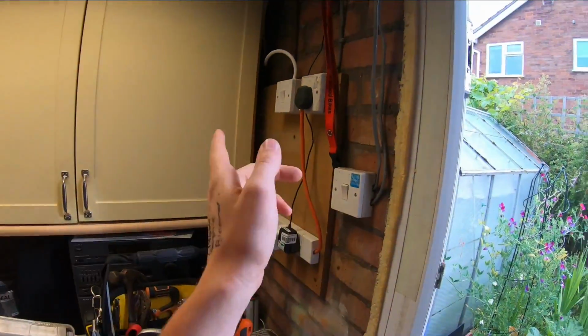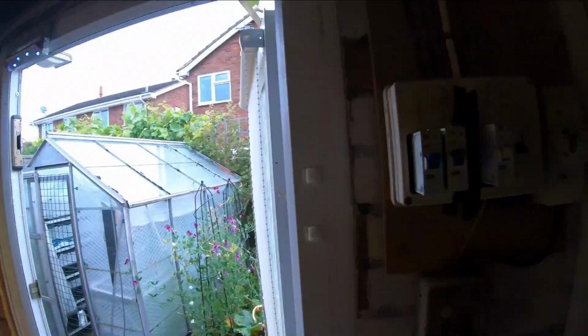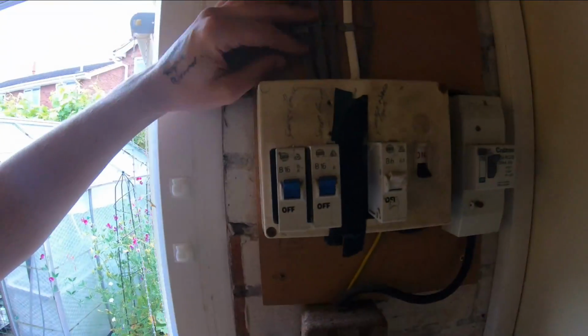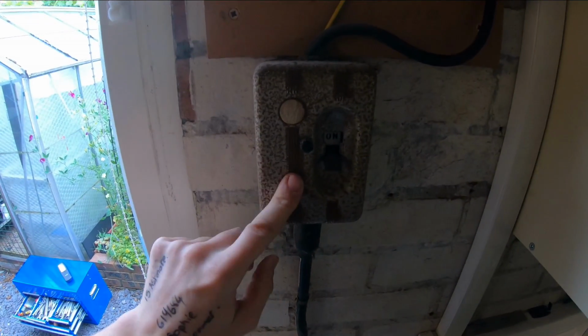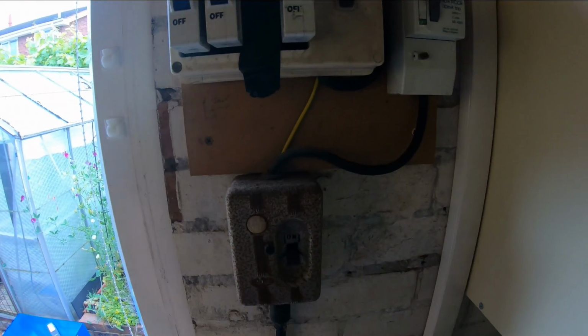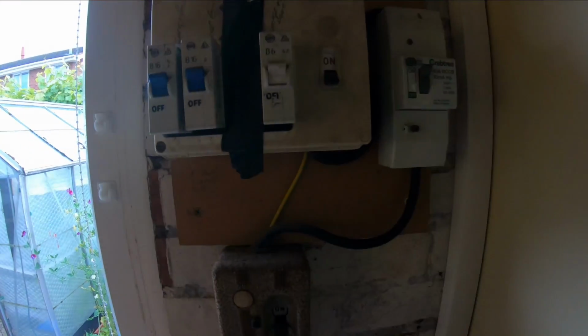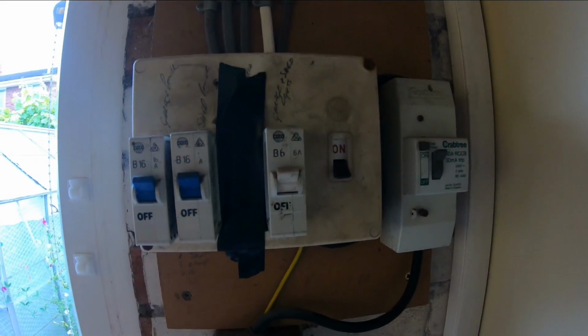And there's a little greenhouse thing next door which is going to be looked at. I think an IP rated fitting's going up. So I'm going to mark out what's what if needed. Get this isolated at the fuse board. Just disconnect the earth and the whole thing from the board, purely because I don't want to be tripping the main house off the same RCD. And yeah, I'll get this stripped out and I'll see you in a sec.